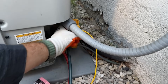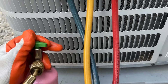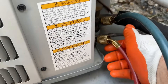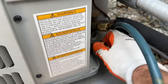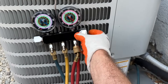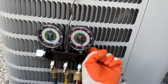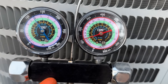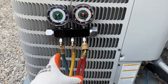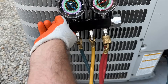Now I'm going to show you one last tip on how to remove the gauges. We're going to turn the system off and start by removing the high side — watch how little refrigerant comes out because of these low-loss fittings. Now we have the high side taken off. Basically 300 PSI of refrigerant is trapped in these hoses, so what we're going to do is open both of these valves. You'll notice the high side is going down and equalizing with the low side — we've essentially let that 300 PSI go through the manifold into the blue side and back into the system. That preserves the refrigerant and keeps it in the system rather than taking it out with the gauges.